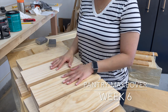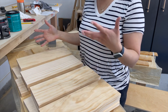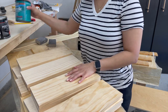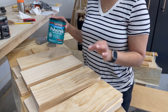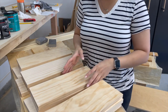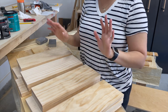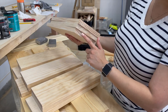Today I'll be showing you how I made the produce drawer with dividers. First, after measuring the drawer size based on your cabinet frame, cut everything to size. I have the back pieces and two side panels for four different drawers. Ideally, apply your poly acrylic clear coat or paint before you build, but I only did one coat on one side because I'm on a time crunch. Look at all your pieces and decide which side faces the wall — put the less attractive face on the outside against the wall. Then label everything — right, left, and back.